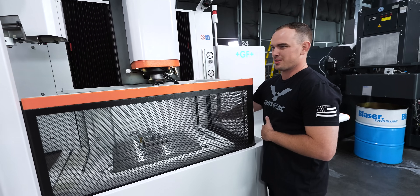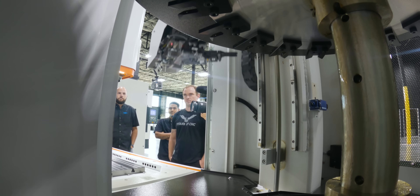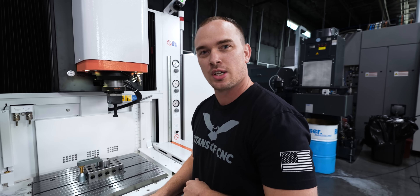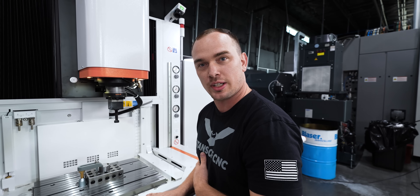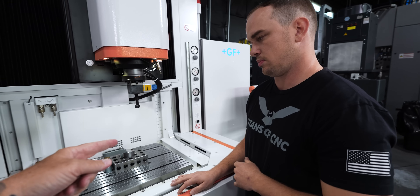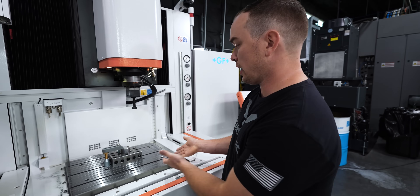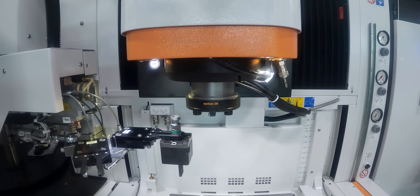The tool changer is a 32-station rotary tool changer — really compact. We can load it up with 32 electrodes and run different jobs across our table, running continuously with those 32 station tool changes. We also have System 3R fixturing so you can fixture super quick and change tools seamlessly. Our table even has System 3R, and all the tool holders are from System 3R — the best EDM tooling on the market, period.